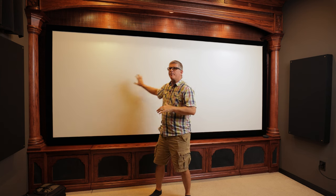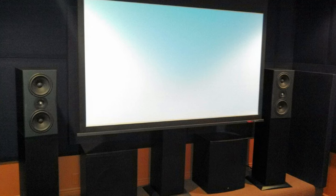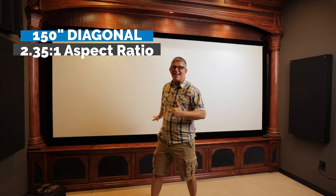Last night I was watching a movie and that's what got me thinking about this video. I loved being able to hear everything placed exactly where it was on my screen. Now, one thing to be careful of — I've heard some guys say it's better to put your left and right speakers outside the screen, especially if you have a small acoustic transparent screen. If you place all your speakers behind a small screen, you don't have a ton of separation between left and right and it can collapse your imaging.